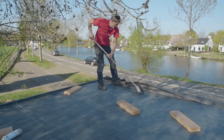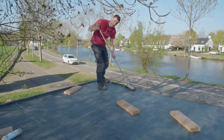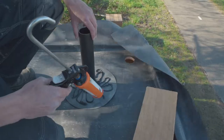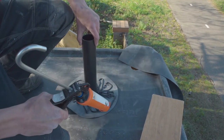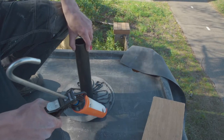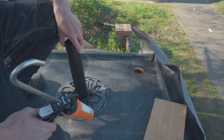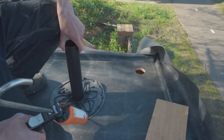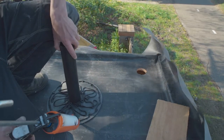We are using this broom with soft bristles to work the film into the joints even better, but it is already looking very good. We are applying sealant to the film around the gutter drop. Use a pattern of curves and make sure to go all along the outer edge. If we manage to squeeze some of the sealant onto the roof from underneath the film, we will be sure of a watertight seal.